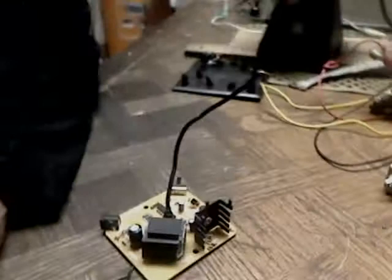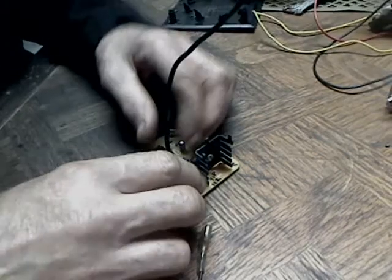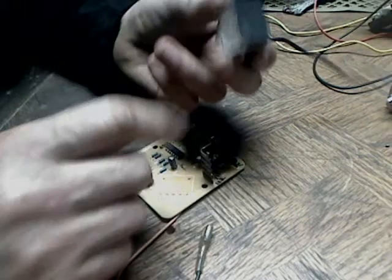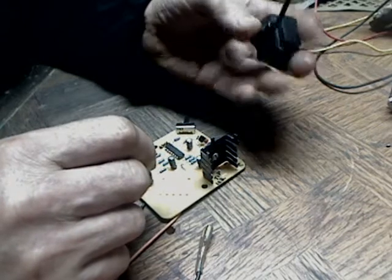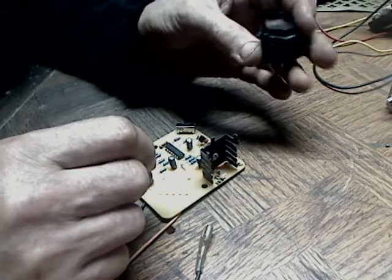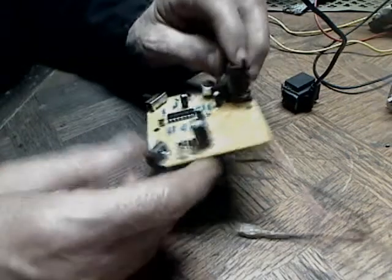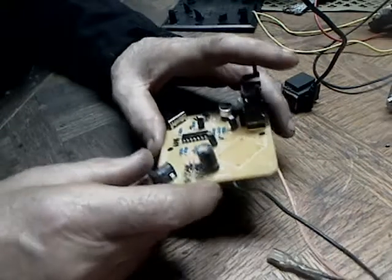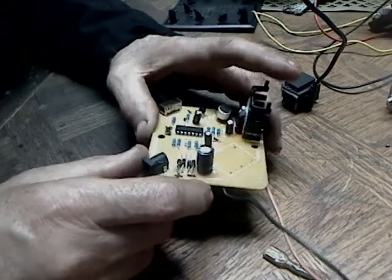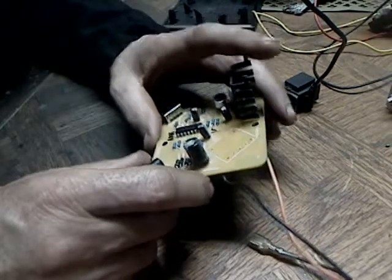It's April 19th, 2019. Here's what's left. I believe I burned up the transformer in it pushing it — 12 volts, 1.9 amps. I think its normal operating range is around 10 volts at three-quarters of an amp, about 7 watts. I'm pushing this thing closer to 19 watts.